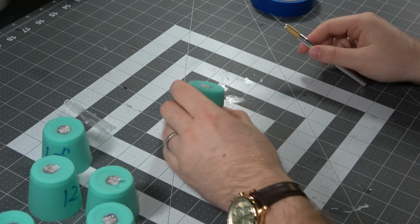After you cut down a little bit, I cut about halfway down the side of it so that the mold will stand up on its own. The dice pop right out, and you can see here that's a completed mold. It's also got the extra part called the sprue there, where excess resin can go over the top, which you want to make sure you always have a little bit of excess. I like to take a little bit of blue painter's tape and take it around the outside of this thing and pinch it up the side so that it's a nice tight seal all the way around.